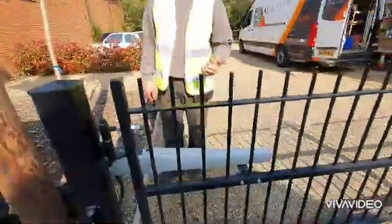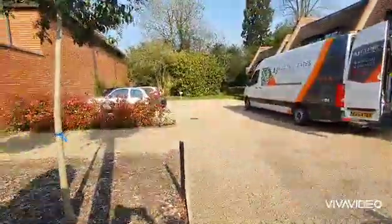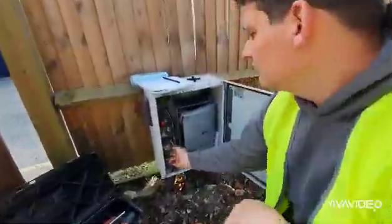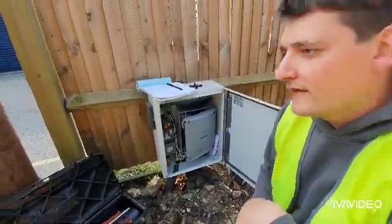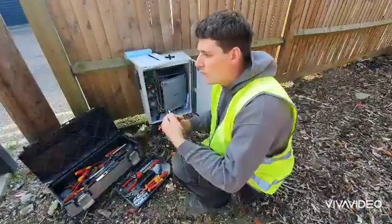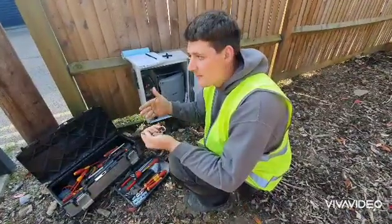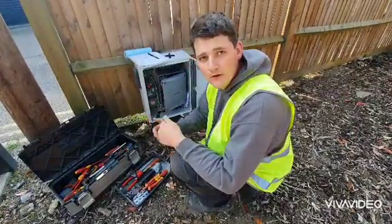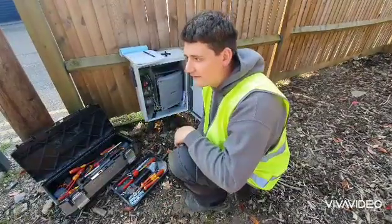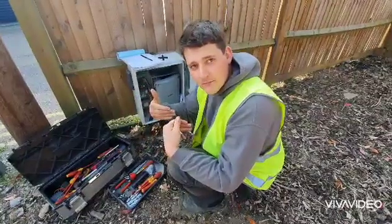And then lock. With that done, we then come back over to the power. We switch the power back on. It's a good idea to let it sit for a minute or so, because you might find that some systems will automatically make their first manoeuvre and try to close, and then they'll be back up and running. If however they don't, use your remote and press it once, making sure that you're clear of all of the sensors and of the gates. They should go through one sequence and then they'll be back to normal.